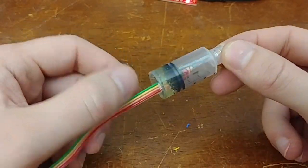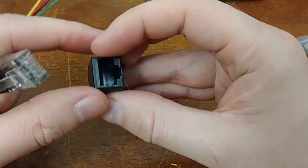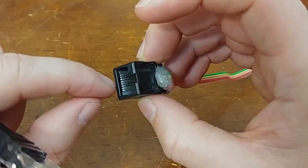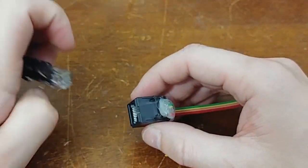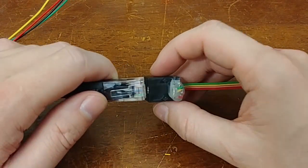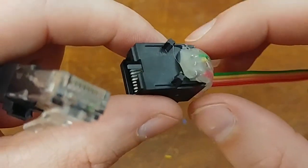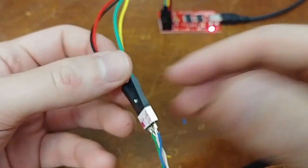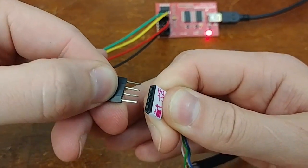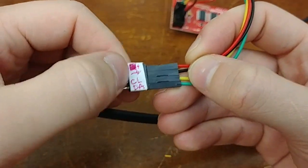After wiring those four lines, I connected them to an ethernet port and made every other pin ground, so all the twisted pairs are twisted with ground. I only connect ground on one side of the connection. You can Google how to use twisted pair to send I2C over a moderate distance. This is my development cable — it goes straight through to some headers. I added little labels so you can see they're in the same order: plus, ground, clock, and data.